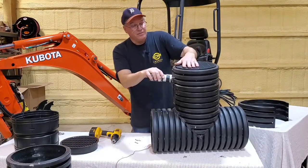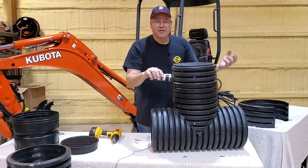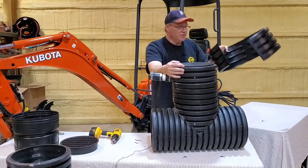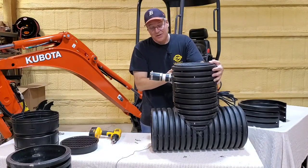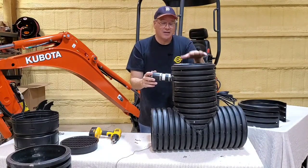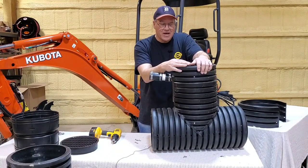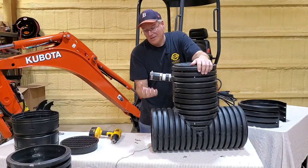You'll take this cover off with that T25 driver, go ahead and remove it, put your extension on. We don't use double bell for risers. We use the split couplers for risers. And there's a lot of reasons for that. We want it to be strong and sturdy, and we don't want the riser to rock any, okay? So it's super easy to add a foot, 18 inches. When you start going beyond that, I do recommend a custom build, because now your discharge is so very deep.